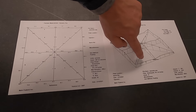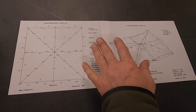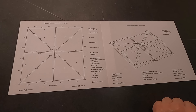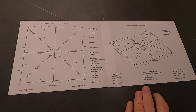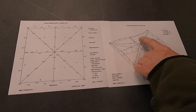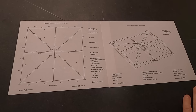It's my understanding that you really do want to finish them a bit high in the middle — they talk about loading a plate, and granite will move when you put weight on it. So traditionally it's a little better to have it high in the middle, perhaps sloping off of that. Either way, we're not very far away from an A plate. Then if we find any holes — that's the unknown right now. If we find a hole, we could go from having to lap it maybe half a tenth to something way bigger. The repeatometer checking local flatness will cover those areas.